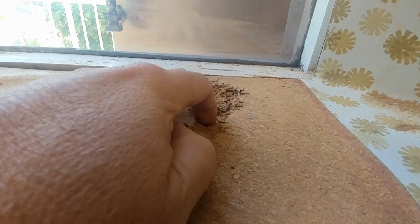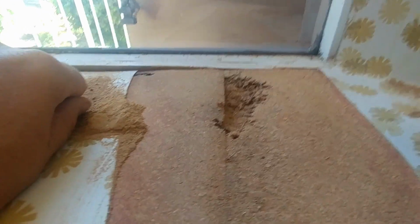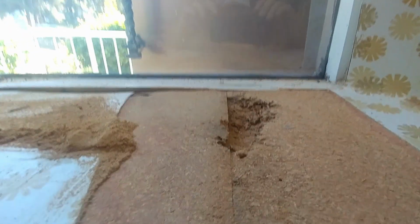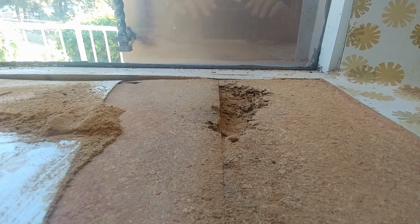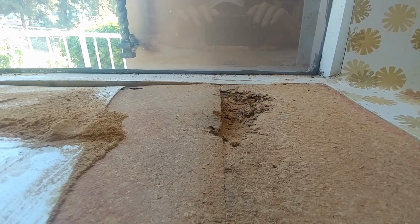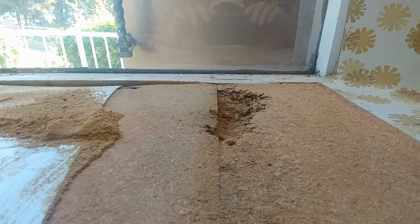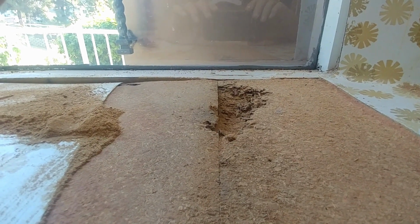So what we'll do is, they actually had termites right here. You can see all the little tunnels. I don't know if you can see them now, but I kind of chipped it away. And what we're going to do is chop back all this stuff out, and then we will put our skim coat of Bondo on it, block it out, and we'll sand down most of it and block it out, and then we'll put our filler Bondo on top of it to smooth out any imperfections.